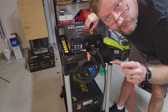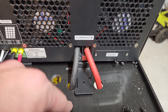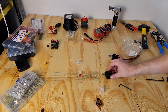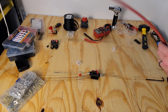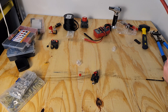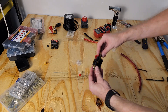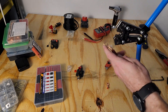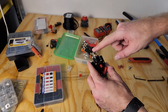Pro tip: make sure you open the screw all the way up. I probably could have moved these holes a little further out so the bend wasn't quite so tight, but I think we'll be okay. That's a 150 amp breaker, and I've got a little pigtail of four gauge wire. I'm going to put an M8 ring terminal on the jumper, then insert my power wire from the inverter into the other side and crank it down. I'm also putting heat shrink tubing over the Allen clamps to make sure it stays in.